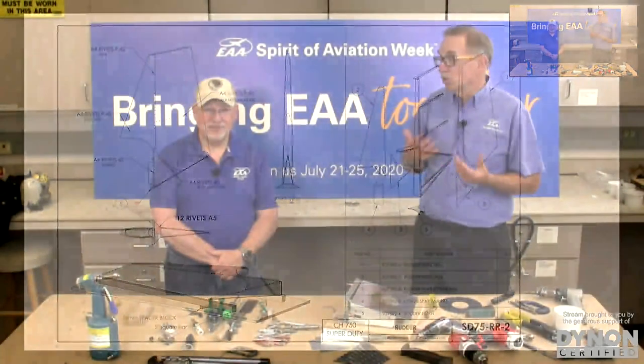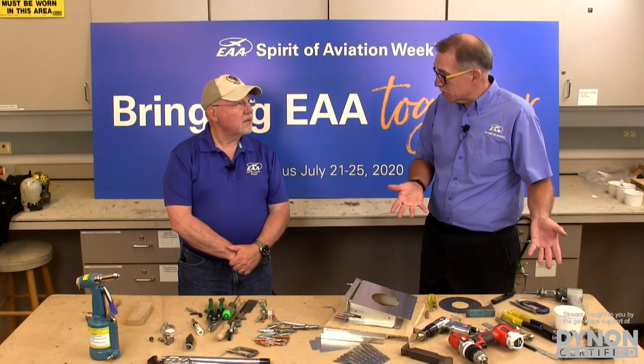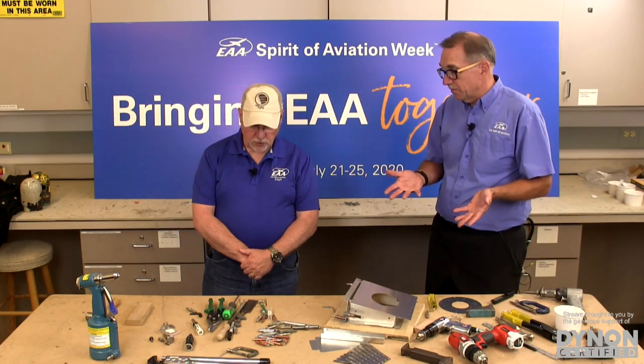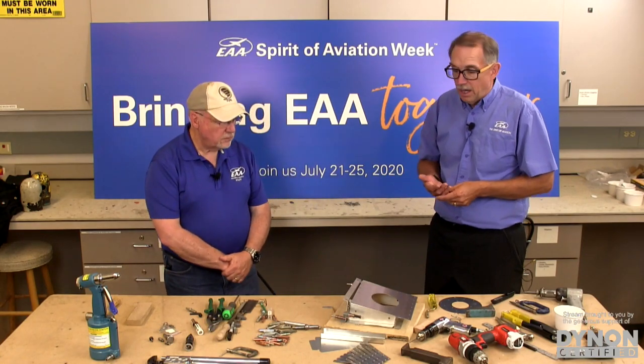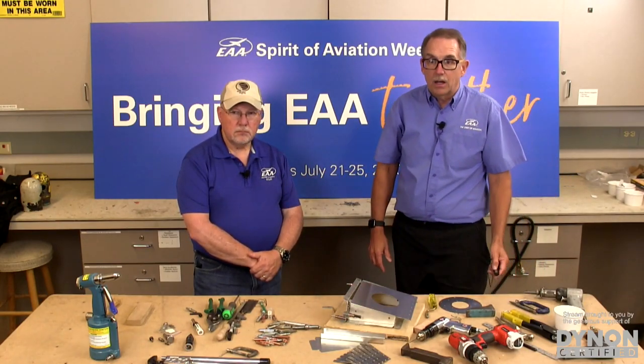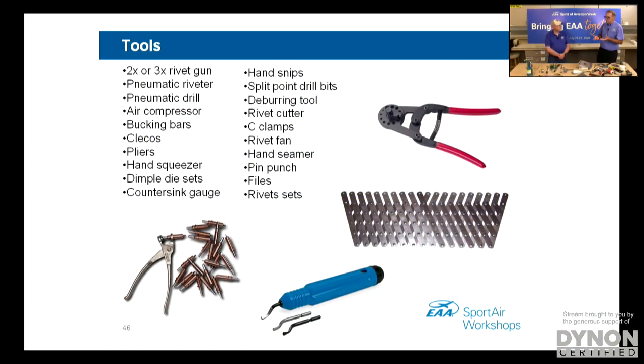So the other big thing is tools. With a sheet metal airplane, you need a collection of tools to build the structure. Now, for most sheet metal airplanes, there are some specialty tools that you need. It's not stuff you can buy at the hardware store. We have a suite of tools lined up here, but if we look at a tool list, it might look something like this. Whole bunch of specialty tools. The two things that stand out in terms of tools that you just can't go out and get really easily would be a rivet gun, a bucking bar, some of the temporary fasteners, some things that help to modify the sheets for installing flush or countersunk rivets, and things like that.